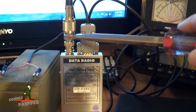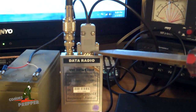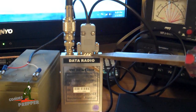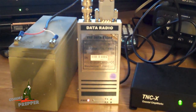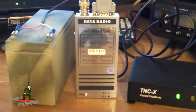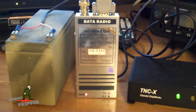I have SO239 to BNC adapters — the radio has a BNC connector. The inputs here on the radio go through a DB9 connection; it includes power and signaling. This is all programmable, so there are no other external switches or knobs. You can get the software for free from Argent Data, and I'll put the link down below to program up the channels. To change channel, you pop this cover off — there are four screws and there are dip switches inside, so you can put multiple frequencies in. To change frequency you've got to pop the cover off and set the dip switches.